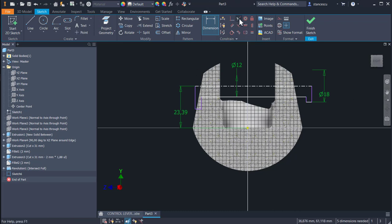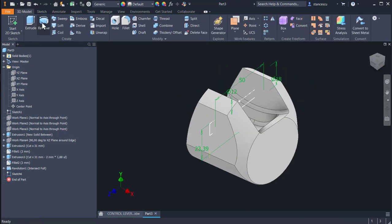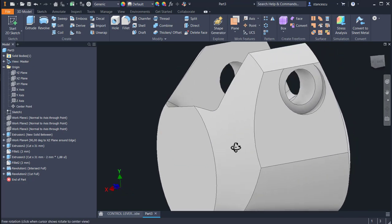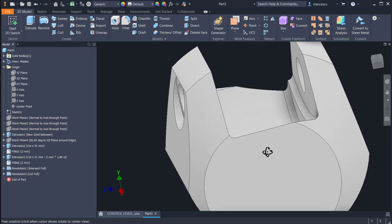The dimensions are in the drawing. This must be collinear with that one; this is fifty; and the horizontal between this point and the center point must also be applied. Coincident this line with this end — now we have a fully constrained sketch. We apply revolve as a cut and obtain both counterbores at the same time.